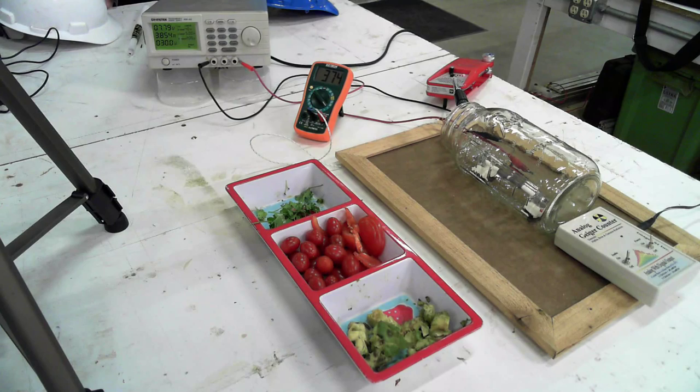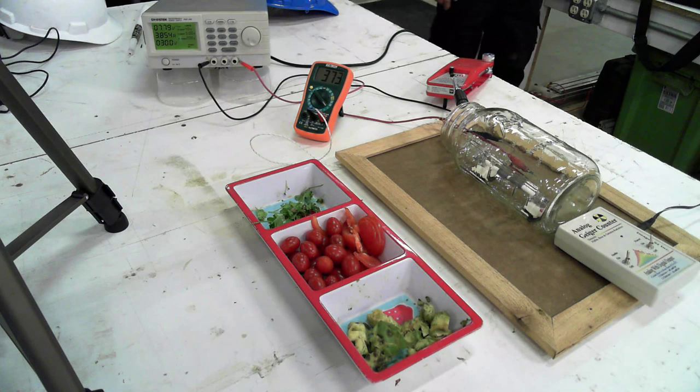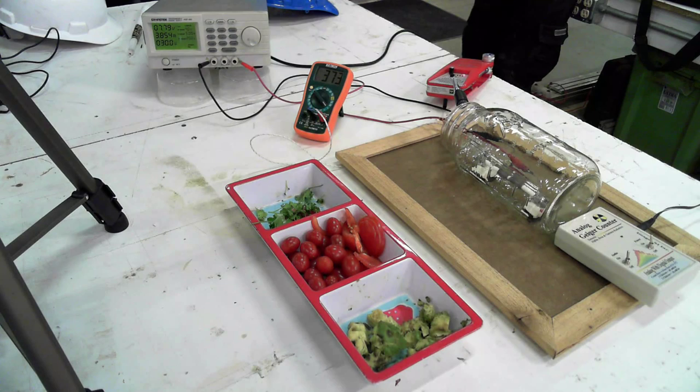There's a chance that the pressure on the Swagelok could cause stresses in the aluminum. I mean, you've actually got a technique to avoid the stress. Thanks for reminding me, because you don't want to stand in the line of fire. If one of those Swagelok fittings does come loose, it would be at a force of above 30 kilograms coming out of the tube. And it would travel a good long distance and probably hurt if it hit somebody. So there are some issues to think about with failure.